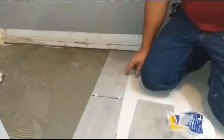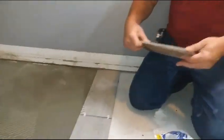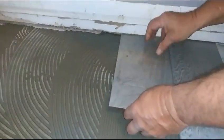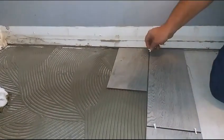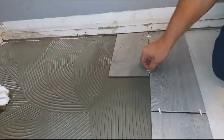I'll be on my knees for a few hours, and I'll show you what we're doing. Okay — if you look down here, we've already lined these up, put spacers in between them, and kept them on that chalk line that we set. Now we're staggering those pieces from the saw cut. We stagger the first one like that. Don't want to be too far away or you'll end up squeezing up the grout. Now we're putting the spacers in.